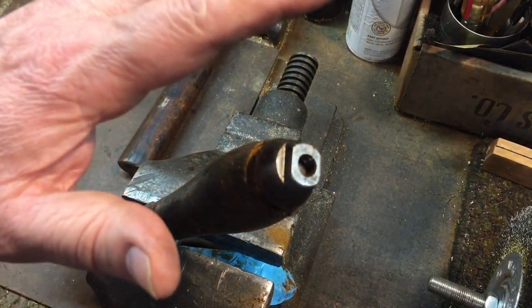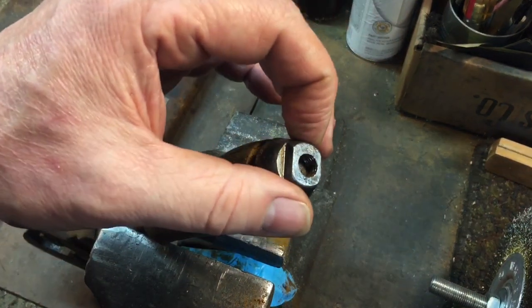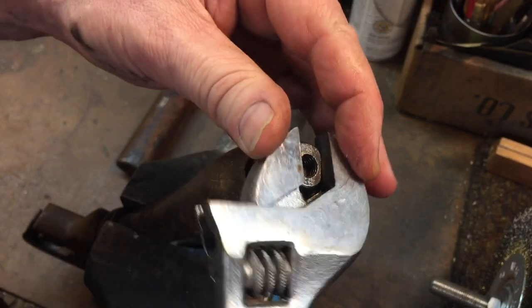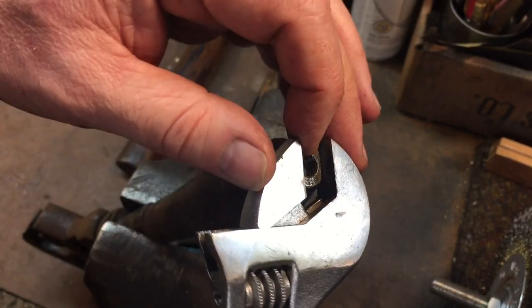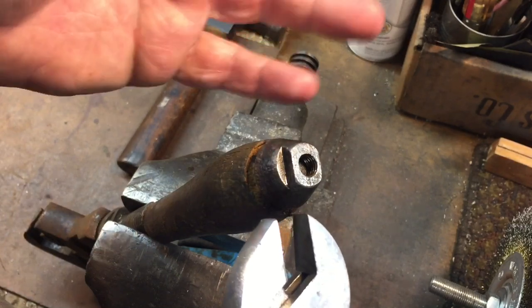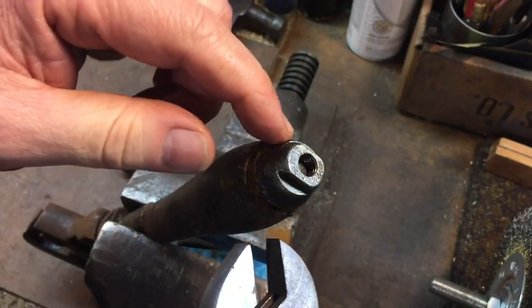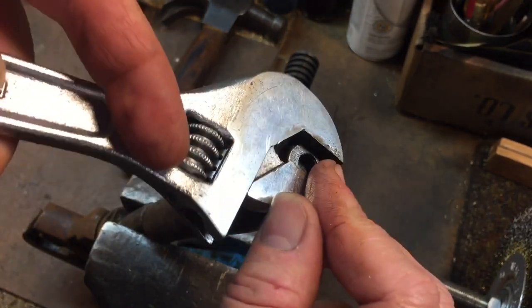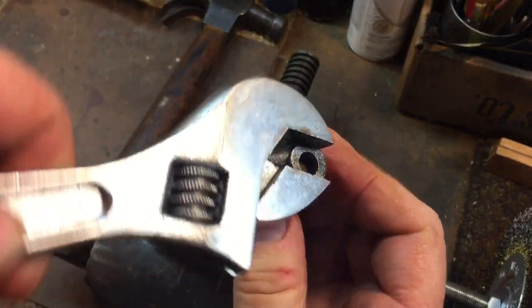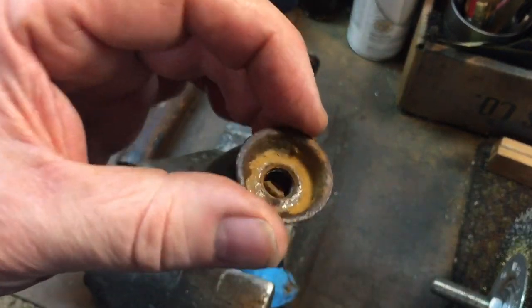Here's why you have to be really careful with these things. These old wrenches not only had screwed-up threads — what I did was I started going back and forth once I saw it loosened up a little with the heat and fluid. I noticed it was getting tight as I was trying to loosen it, and I said, this could be a left-hand thread — and sure enough, it's a left-handed thread. With a left-handed thread, if you put force on it the wrong way, you'd split the handle. I was going back and forth and noticed that when I gave it a little turn it was going down. So with a left-handed thread, of course you have to reverse it to get it off — and we did just that. That's important to remember: left-handed thread.